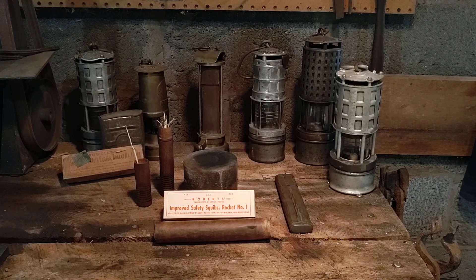To get started, blasting underground first used black powder. Black powder came about in China in the ninth century. It's a mixture of sulfur, saltpeter — otherwise known as potassium nitrate — and charcoal. When mixed in the right proportions, this compound will deflagrate, or burn rapidly, at a subsonic rate. It creates a lot of heat and a lot of gas, and that gas when confined will help push things out of the way.